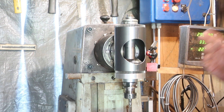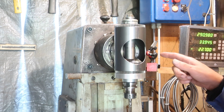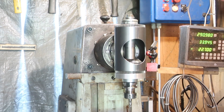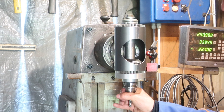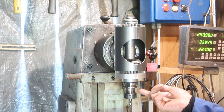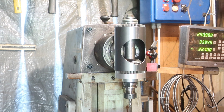It's a bastard to tram horizontally, because there's no way of turning the spindle without turning the whole spindle and the motor and all that — which is a lot of work. You can't really turn it by hand. So when you put your comparator on here, you can't really turn it; you have to slide it on the spindle nose, which is a bit naughty and not 100% accurate.